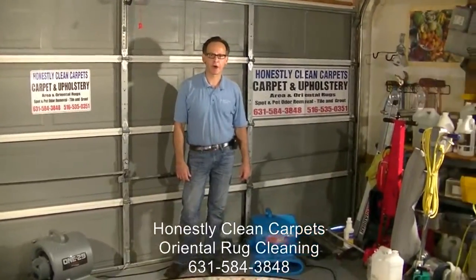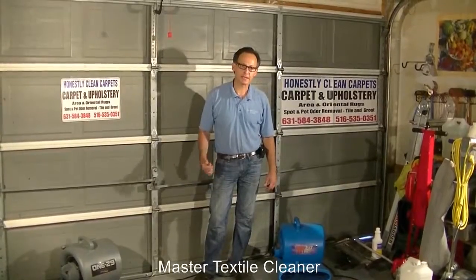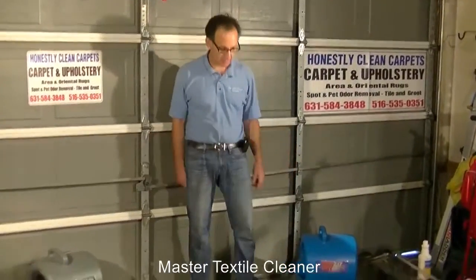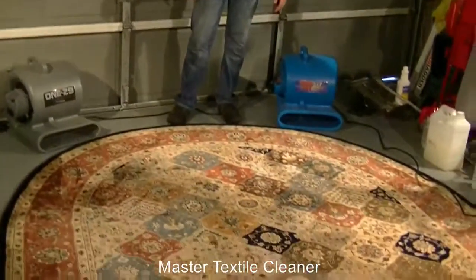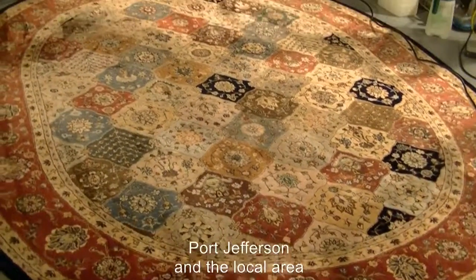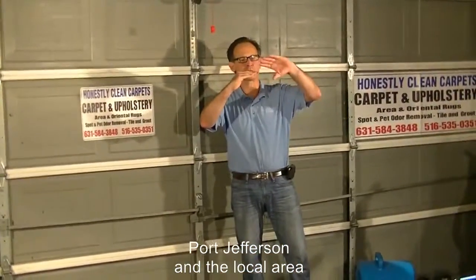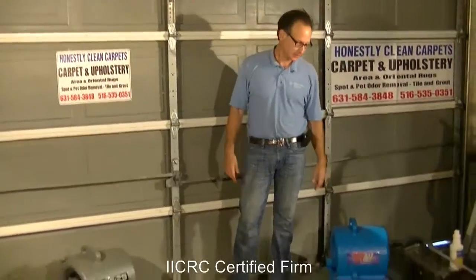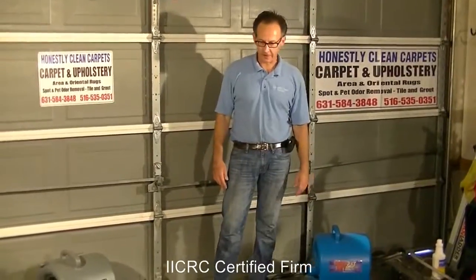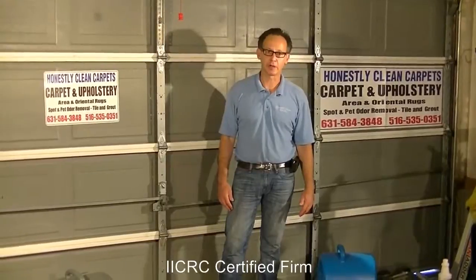Once we're finished cleaning the carpet, we then want to dry the carpets as fast as possible. So a technique that we use, one technique, is to use these air movers. Once we're done, we set up the air movers, which typically decrease the drying time significantly. The concept is that right over the carpet fibers, it's 100% saturated, the fan blows it off the carpet fiber, and it continues to release. So this will take drying time from many hours to really just a couple hours, 2-3 hours.